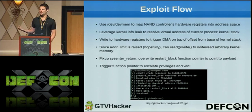The gist of it is, poking and prodding hardware registers like this is never a good idea, and in this particular case, it conflicts with the driver's usage of this hardware. So when you trigger the DMA, the hardware sends off an IRQ saying, "Oh, I'm done doing DMA," and the driver receives it and goes, "Why did you just tell me that? I didn't ask you to do that." And then on Linux, the default response to a spurious IRQ is actually to ignore that from then on. So at that point, your NAND flash controller can no longer perform DMA, and your primary storage goes down, and the box is totally useless until you reboot.